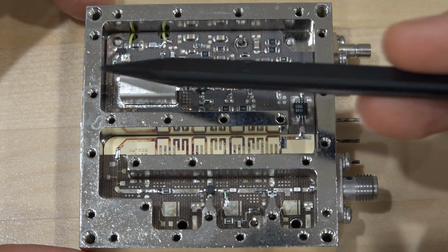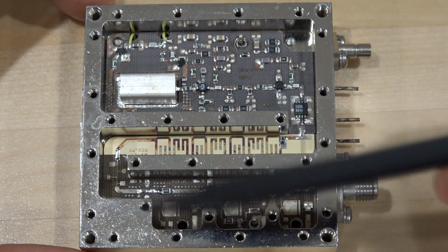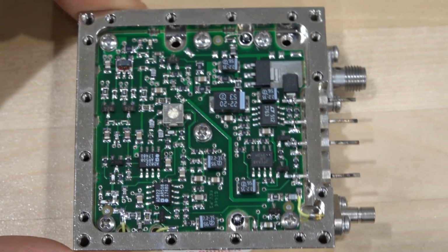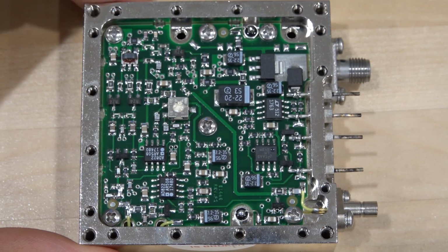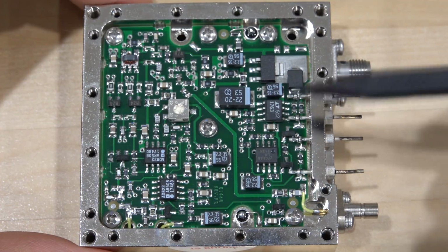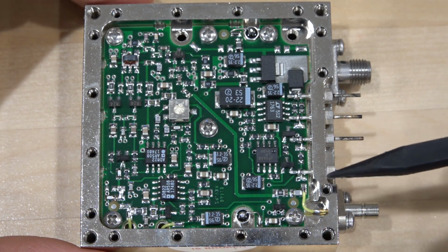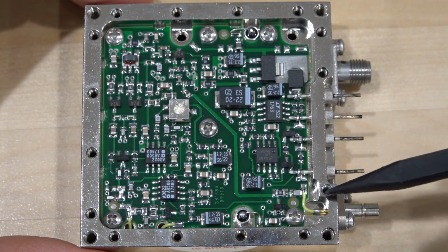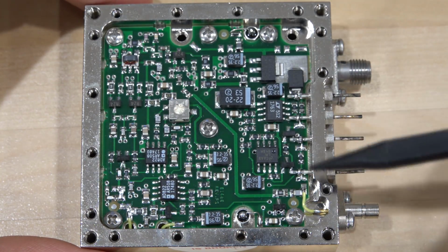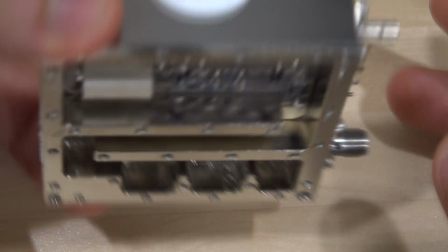So therefore the DRO section, this oscillator, has to only be locked from this portion at 1.8 gigahertz. The rest are just a feed forward section. And on the other part, we have all the circuitry required for biasing, the charge pump, phase detector, blah blah blah, all that stuff. I haven't really looked very carefully at it, but anyway, typical synthesizer architecture. Maybe they're using some other sections. I'm not really paying attention to it right now. I am concerned with getting the other section working. So yeah, pretty straightforward. It may not be using a traditional PLL structure, but not interesting since the PLL is actually working. We can worry about that section later.